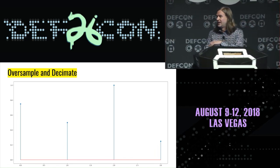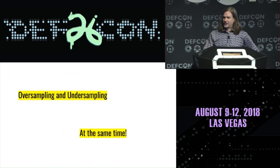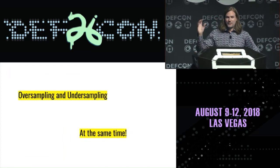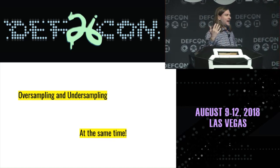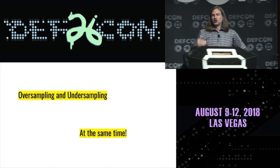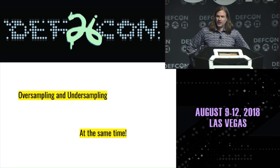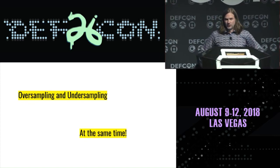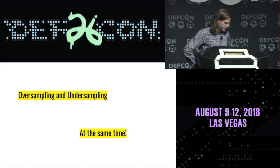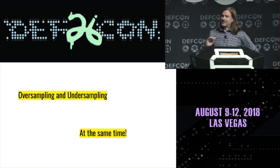Now, interestingly, Dominic, I think, was the first person to point out that not only are we oversampling in this demo, but we are also undersampling. That may be hard to wrap your head around, but we are, in fact, sampling at a sample rate that is lower than that 44 megahertz output of the TV tuner. We're sampling currently at 20 million samples per second, which is quite a bit lower than the 44 megahertz intermediate frequency that we have from that TV tuner. And it turns out that works fine.